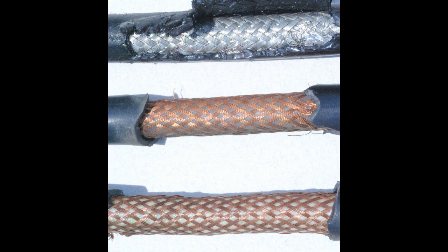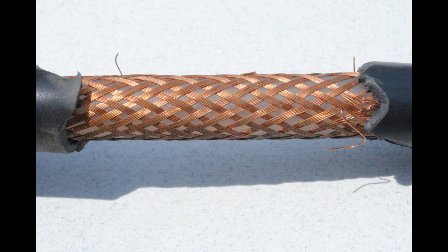Today we've got to talk about your coax. If you've got coax from DX Engineering, Tim gets everybody squared away right. I've opened up the top coax there — it's got a nice 98% braid and 100% shield, and it's UV protected. The medium coax in the center — look at the holes. The bottom coax? That coax stinks. If you're above 30 megs, all that signal is going to leak out.